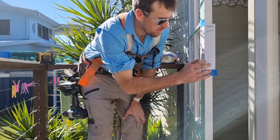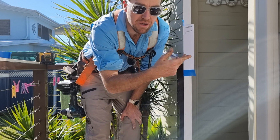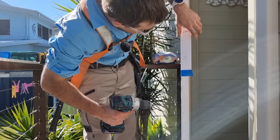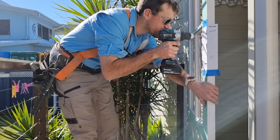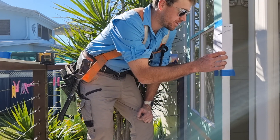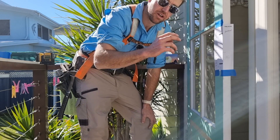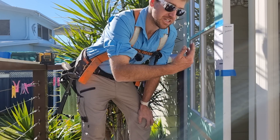I've just put this template on to use as my reference. I've put one little hole in the center there and I can line that up with where my mark is, then the rest will marry up nicely. Sometimes these templates are just paper, but this Gainsborough one is a pretty nice cardboard one, so I definitely recommend using it. There are seven holes in this one, so you're just better off using that template and you can't go wrong.